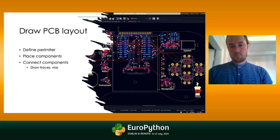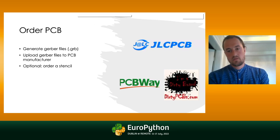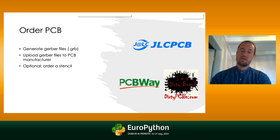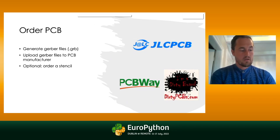That is the last step of the design process. After you've done that, you want to order your PCB. These design tools have a way for you to generate so-called Gerber files, which are a standardized format that defines the production process. You can visualize the Gerber files and see if everything makes sense or if something is wrong. You take these Gerber files and upload them to your PCB manufacturer — I listed three of them, and the one I've used the most is JLCPCB, a Chinese PCB manufacturer. As an option, you might want to consider ordering a stencil, which I'll shortly explain.